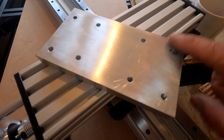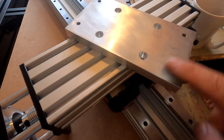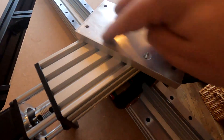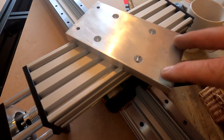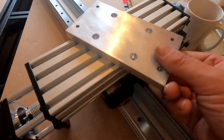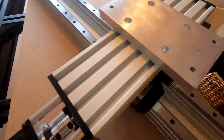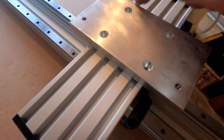Here's the 12mm plate, 80 by 150. Turn it over — the top face. Here's the tap, 6mm, drilled and tapped to accept 6mm cap-head screws. These are counter-bored and drilled clearance to accept 5mm screws. The 5mm screws will drop in there, and you'll see they marry up to the 60mm pitch — 60mm pitch from there to there.